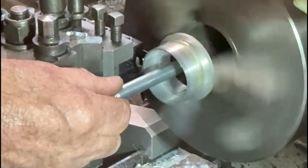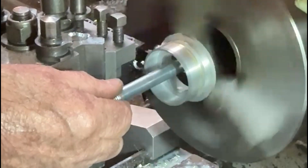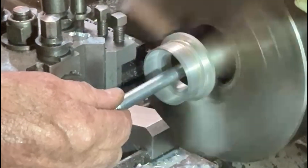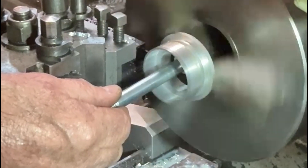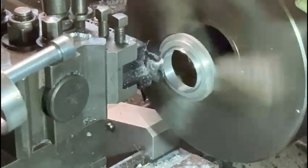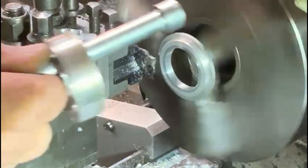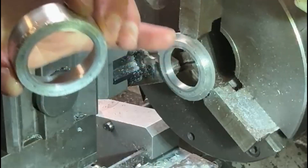Here we see the finished aluminium unit. It's a 20mm outside size for the depth of the bore I put on the wheel, and the inside depth of the cup is 14mm to take the bearing. When this fits it should sit nice and snug into the wheel with some Loctite, basically repairing the wheel itself. Yeah, that doesn't look too bad at all.